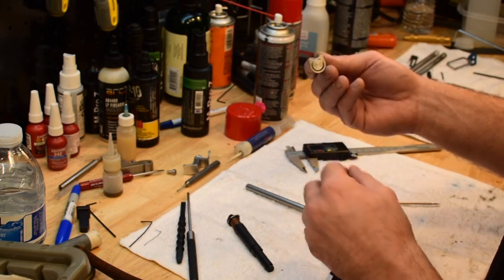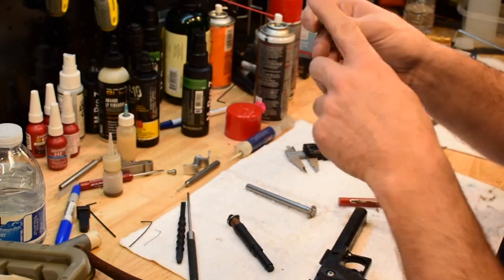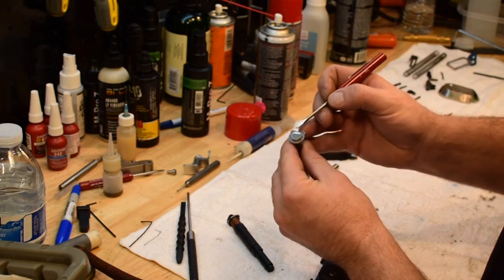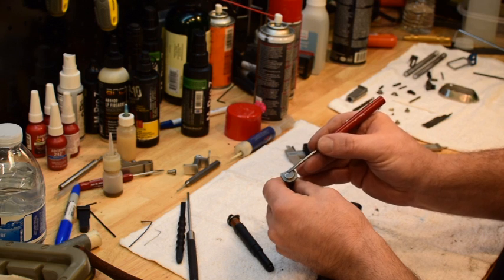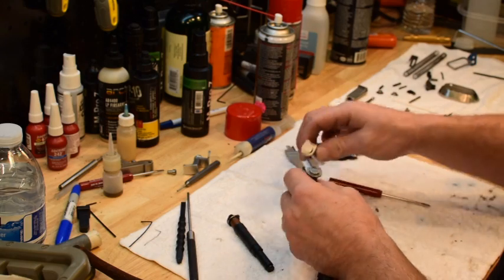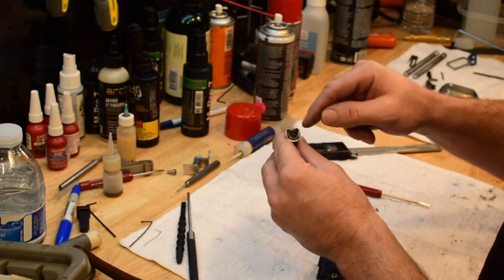And then the other thing that's important is that the guide rod, if it's flat like this EGW one, is going to hit the barrel and bash into the bottom of the barrel and beat up the barrel lugs. So the Dawson, you can see, just comes with that profile already tuned. Sometimes these aren't enough. Sometimes you need to lay that edge over even more so that you're not bashing into the bottom of the barrel. So before we put this in a gun, we would cut that.